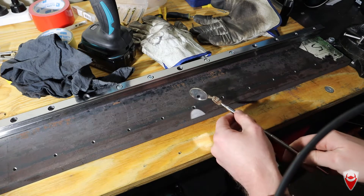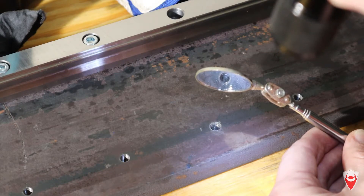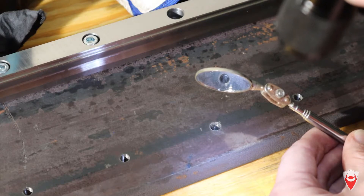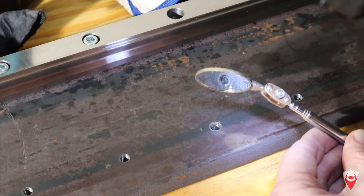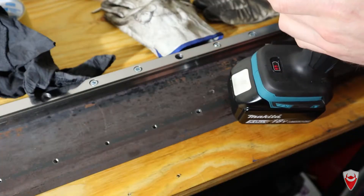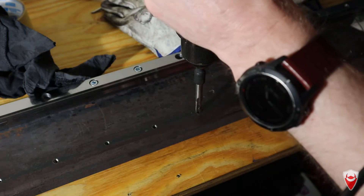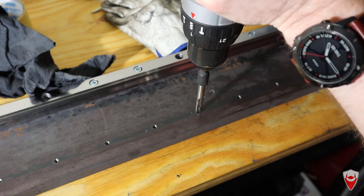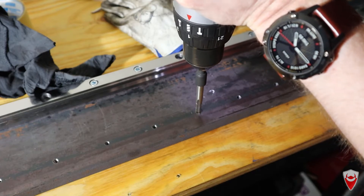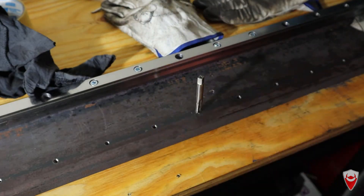You can see there's a step at the bottom of the hole where the drill went down, and if you look at the edge it seems pretty well centred around the original hole. That means the new hole I'm about to tap is fairly well aligned to the old one — so we should be concentric and in the right spot. I know this is a terrible idea but I'm going to power tap this one — probably the best way to get it straight — noting that the hole is a little bit out of square, and now I can hand tap.